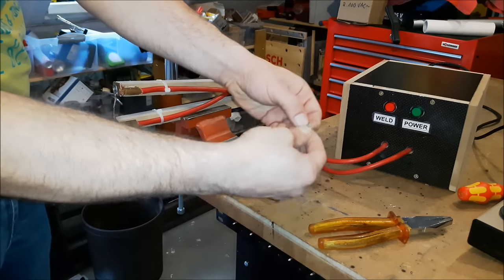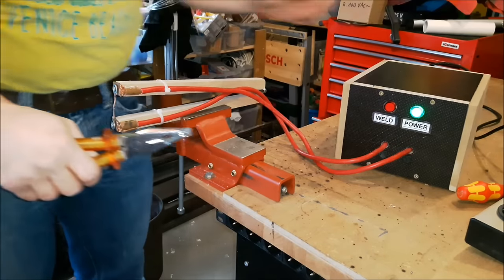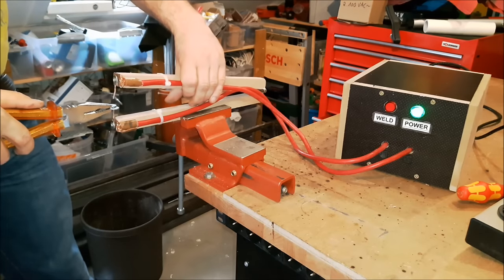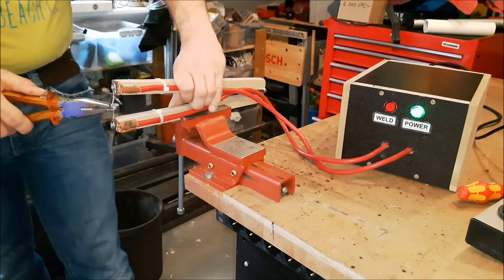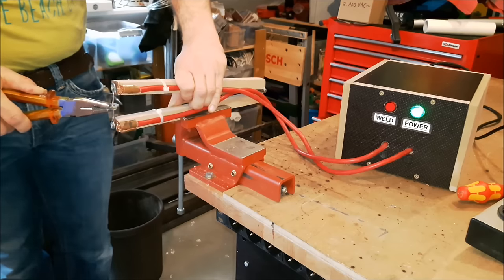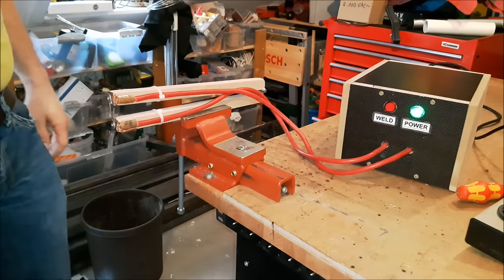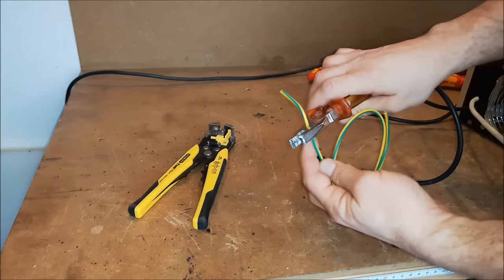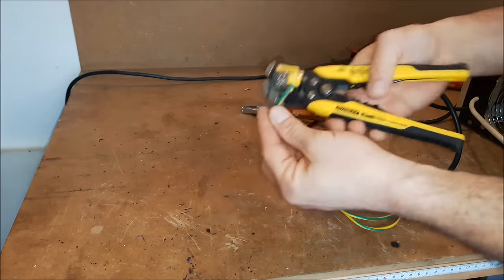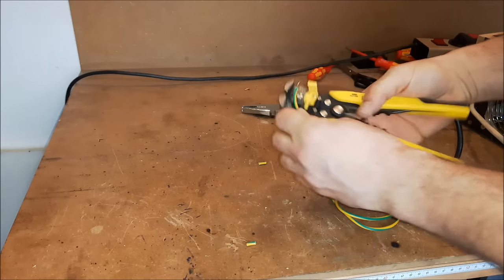After a lot of hard work, I'm finished. Now it's time to do our first real weld. Power on. For a decent spot weld, we need heat and some pressure, so keep the clamps together for a few seconds after you've finished welding. And it works! When working on a project like this, I always have some ideas. My first idea was to do some better electrodes, since my very thin electrodes made from copper wire didn't weld very well, so I made some thicker ones.